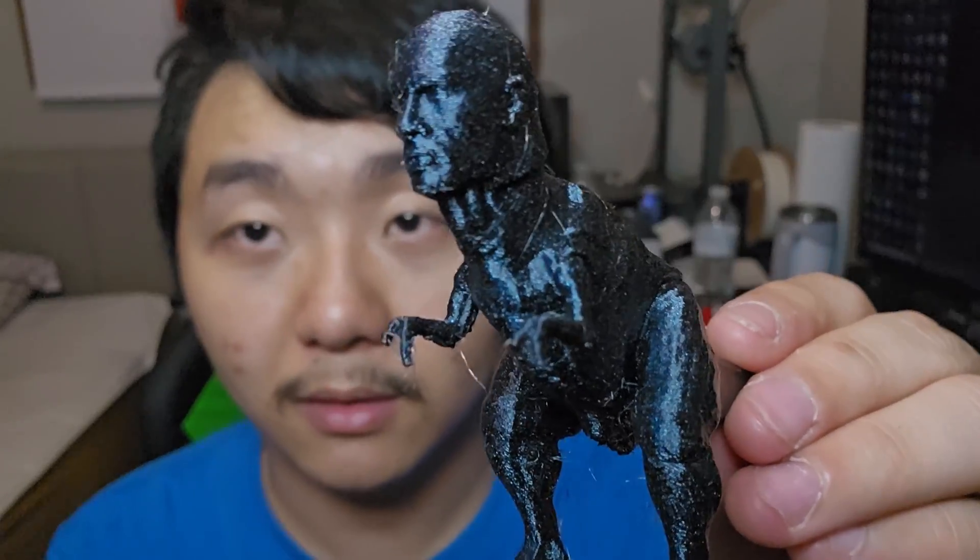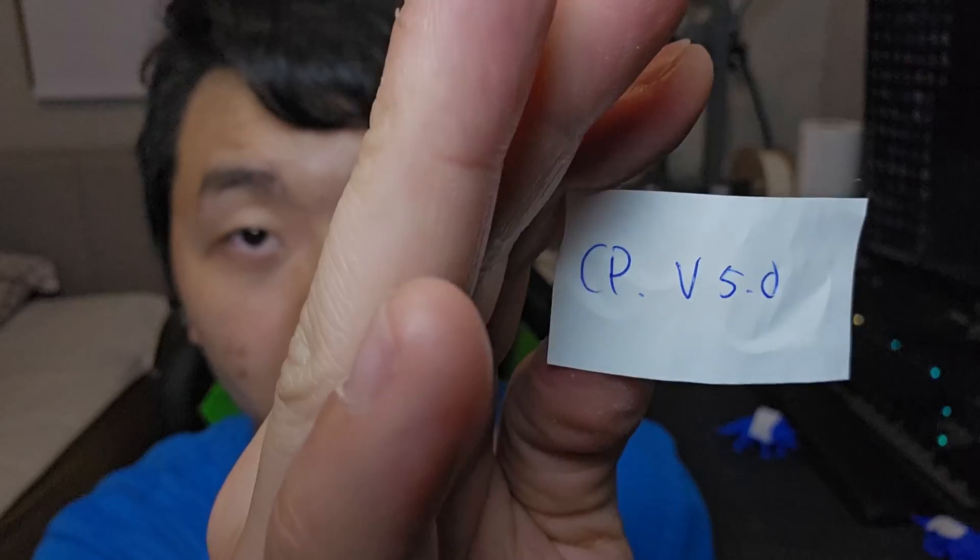Print quality seems really good with PETG at 100 millimeters per second, it's just very stringy from Orca Slicer. I do find that true — the first time I use Orca Slicer it's very stringy. When I check the retraction setting on Orca Slicer, there's no value — it's set automatically. But when I fine-tune that it prints really nice with no stringing at all. Since I used the default settings for this test, it's very stringy on Orca Slicer.